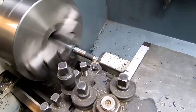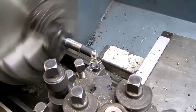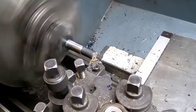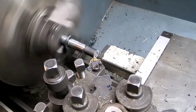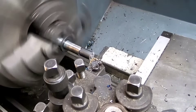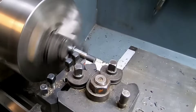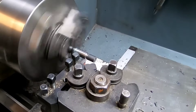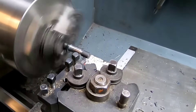If you're getting anxious to see this get welded up, we're almost there — but there's one step left. I'm gonna cut some V-grooves in the end of this and in the side of it, because I've got to fill those V-grooves in with weld. If I welded just on the surface I can guarantee it wouldn't hold as well. It is shrink fit on there, but it's not gonna hold as well as if you throw a weld on there too. This is really a test of how well the shrink fit worked.